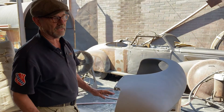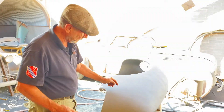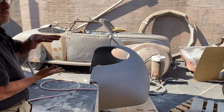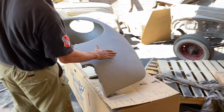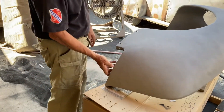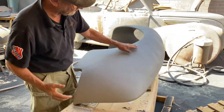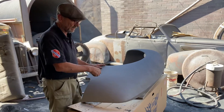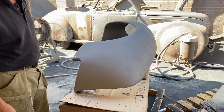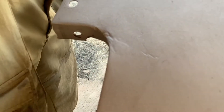When sandblasting, make certain the nozzle is skipping off the surface — never turn it 90 degrees to the surface. You could bore a hole through metal with a sandblaster, but more likely you'll get it hot on the blasted side while the back stays cold, causing it to wave and warp quickly. You've expanded the molecules on one side but not the other. Keep a skipping motion across the surface, never concentrate on one area — keep it moving, keep it at an angle. See how beautifully this fender has come out without any warping.